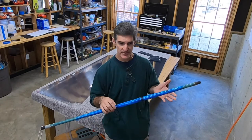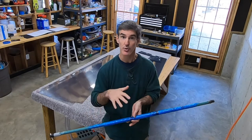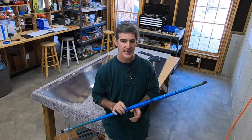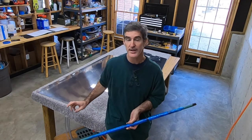Vans tells you to just peel the stuff off — they say the longer you leave it on, the stickier it gets. Regardless of how much stickier it gets once everything's assembled, on parts of the plane that have a lot more curvature, it might be more difficult to peel that stuff off using the broom handle. So maybe it's wise to just get it off. Since I've been doing everything on the carpeting here, I think I can keep from scuffing everything up pretty well. So for the rudder, I'm going to go ahead and peel the stuff off of both sides. If they do get scuffed up more than I'd like through handling, then I'll go back to leaving the blue stuff on some of the other parts.